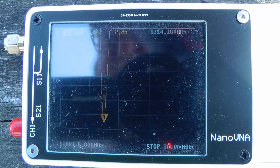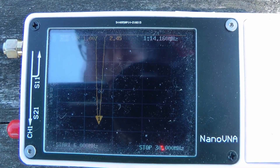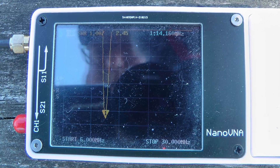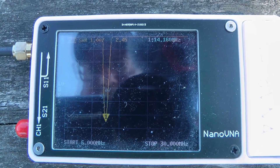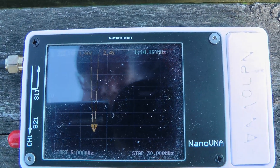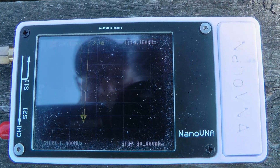And this brings us to my first major caveat with this antenna. After about 10 minutes of fiddling with the counterpoise, with the coil, and with the length of the whip, this is the best I can do on 20 meters — 2.45 SWR at 14.160. That is nowhere near where I got with the antenna the last couple of days at home, where I managed to get it to about 1.5 or better on 20. That's a big disappointment. The antenna is so hard to tune, but I'm going to fiddle for a little while and see if I can get any better.